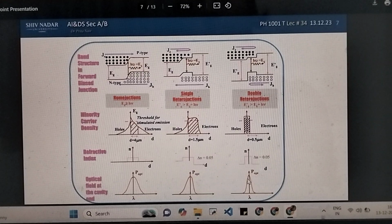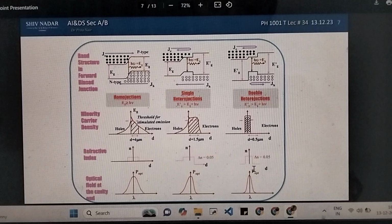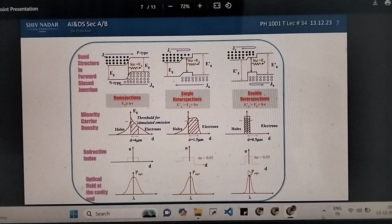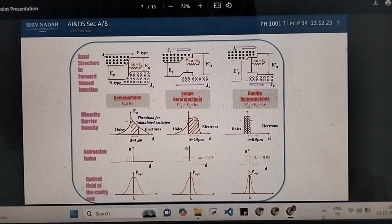Better in the sense that we saw from this graph that there is carrier confinement. Here we are seeing that it's giving higher intensity, because greater power means greater intensity, and more monochromaticity, which are some of the prerequisite properties of a laser. So it seems like heterojunctions, particularly double heterojunctions, are a good idea. So why or how exactly, we'll look at that now.